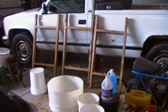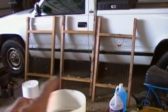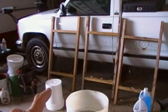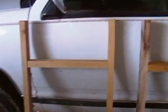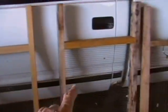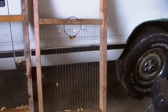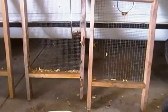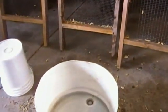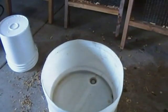Here's my classification setup. The half of a plastic drum I'm using to catch what goes through my sieves — I sit on that pail so I don't have to break my back. There are three sieves I'm using: this one is quarter-by-quarter, this one is half-by-half, and this is half-by-one. They're 24 by 36 inches and all the same size so they stack on top of each other. What I do is take one of the sieves, put it on here, and then take maybe a half a pail at a time and scratch it around until nothing more falls through.